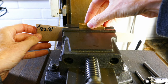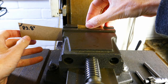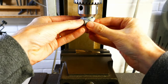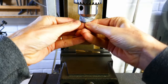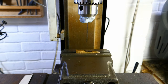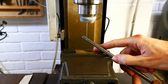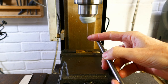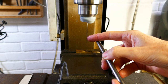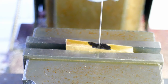I'm using my cardboard template to position the part at the correct angle in the vise. To position the spindle above the centre line mark I'm using the sticky pin approach — a blob of blue tack is attached to the spindle and a large pin is pushed into it. With the spindle slowly rotating you can move the pin so that its point is directly aligned with the mill spindle. The x-axis is then moved so that the point of the pin is aligned by eye with the scribed mark.